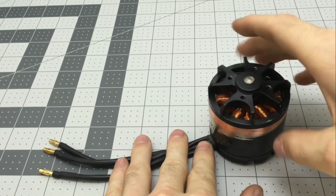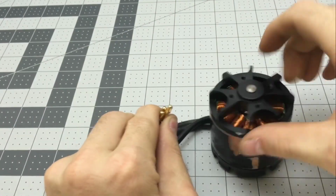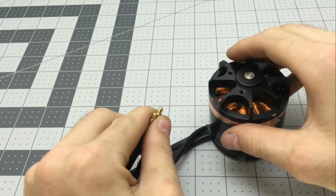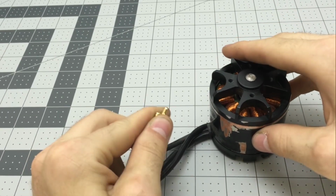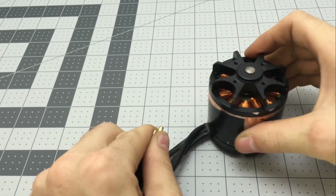The leads are not connected to anything, and the motor, or in this case the generator, is very easy to move. However, if I touch the leads of wires together and short them out, there is very little resistance, and the super small voltage I'm generating is now able to flow. And when there is voltage and the current can flow, now that is electrical energy.